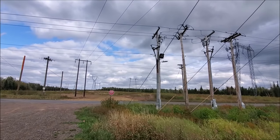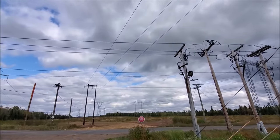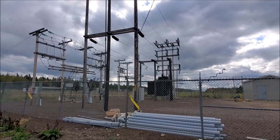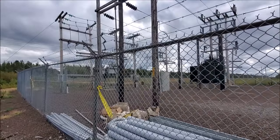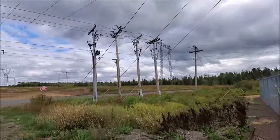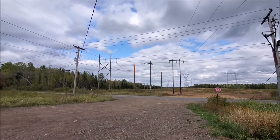There are several transmission lines passing through this area, and this one almost directly over my head is what's feeding this little substation here. Just a fair-sized power transformer feeding into two oil reclosers over there on the left, and they come out a couple of risers out into this rural area here.